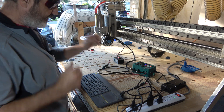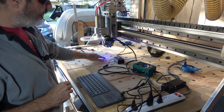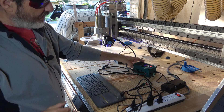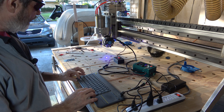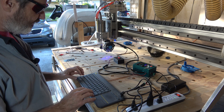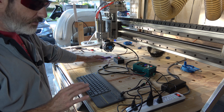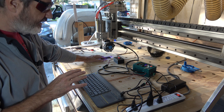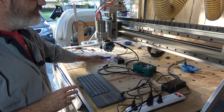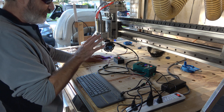Always use safety goggles — safety is super important. If I turn on the focus mode, the laser comes on. I'm not focused very well so it's not burning anything yet, but even at the focus setting with only 0.2 amps going to the diode, it can still burn. Once I get it in focus I'm burning a little dot. You want to use the black card provided to set your focus — you basically listen for a crinkling sound on the card, which is about as low-tech as you can get.